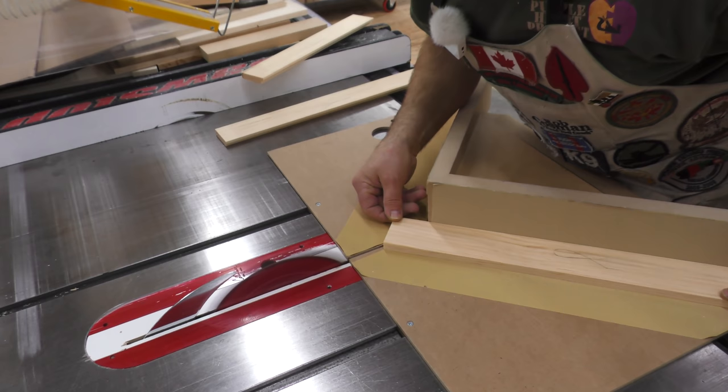So what I did is I've got a piece of plywood, cut a relief corner in there so that I could put that in and that tip is protected. And I can take my block plane, because this edge is sitting up off of the table. It will catch the blade, and I can use this almost like a shooting board and just go in, running my hand directly across. Now, I felt a little leery right there where there's a little bump, so I'm going to do another one. Okay, that's nice and clean, so I'll do two passes on each one.